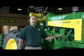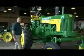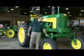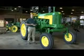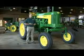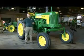As time went on and tractor production continued and evolved, it was figured out industry-wide that there needed to be special types of tractors built for special crops, special applications. Deere followed suit with the rest of the industry. This happens to be a high crop version. It comes with elevated reduction housings, elevated front axles, radius arms. This would have been used in the sugarcane fields, rice fields. It would have been used on bedded crops in certain areas of the country. Wherever you need elevation for ground clearance, this tractor fit that application very well.